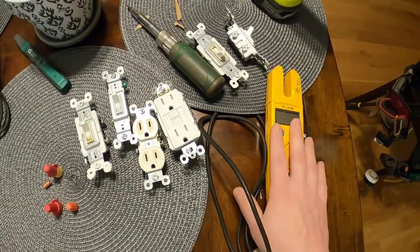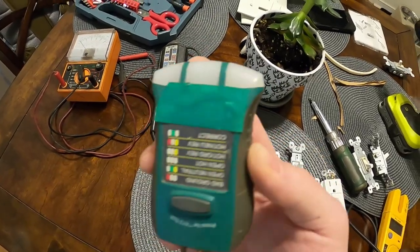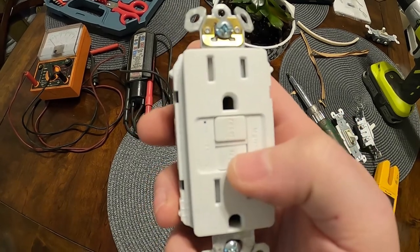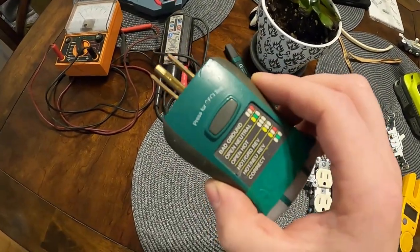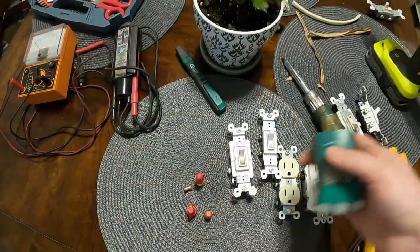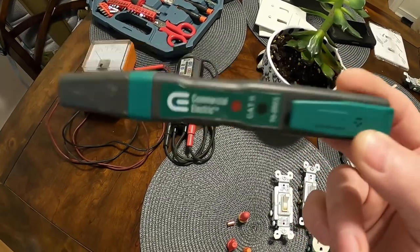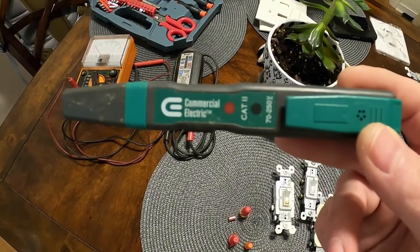You have this type of digital meter, which is expensive. You also have plug testers — you've got to have one of these. They're cheap, and you want one with a little test button because that's how you test GFIs. GFIs are these right here — you'll see them in your kitchen and bathrooms — and that little test button will trip it and test the functioning of that receptacle. It basically tells you if what you've wired up is correct. They also make these hot sticks where you just wave it in front of something that's supposed to be on or off, but I don't recommend these — they will go off at static electricity and they're just not reliable.